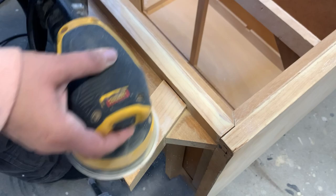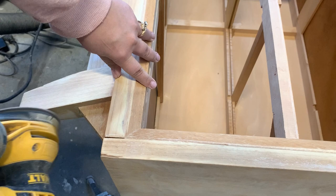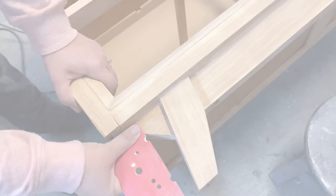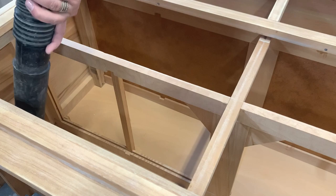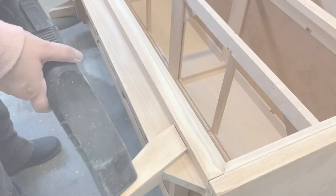The reason why I'm telling you all of this is because you are gonna see that today I am using Wise Owl Stain Eliminating Primer. I will be sharing in detail how this primer is different from the one that I use. It is unlikely that this dresser is going to bleed, meaning the tannins of the wood are going to filter through the new finish. Since the risk is low, I decided that this was a good opportunity for me to try this product.